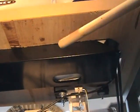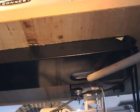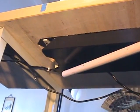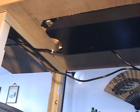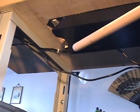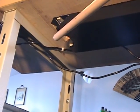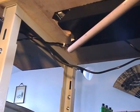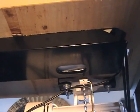This would be the hole that you'd want lined up for the knee actuator if you had one. This end has a notch cut out for putting the bobbin in and out. That means you want the pan to the right as far as you can without having any of the machine bearings drip oil off the tips and onto the floor. Really, you run this pan quite a ways over to the right — make a measurement, make sure you get that, and so you have room for the bobbin.